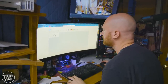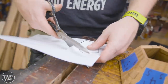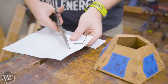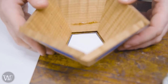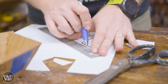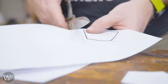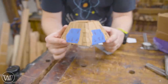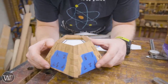Normally I would try banging my head against the wall drawing this out by hand, and there are a bunch of great math ways of drawing out a pentagon, but I find that MS Paint is absolutely phenomenal for printing things to scale. It's very quick and easy to adjust and print out. Just like that, I have a pentagon. I need to find exactly the right size — this is the size at the bottom, but I need it to be bigger because it needs to house into a groove around the bottom. So I'm going to add a little bit of material onto the pentagon, cut that one out, and see how it fits.